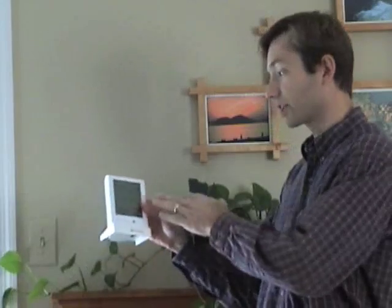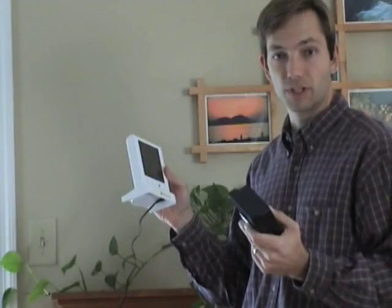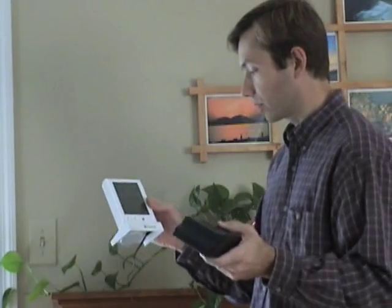When programming inside of the monitor, there are four things to consider. The first is to make sure that the monitor is reading the signal from the transmitter. If the monitor seems to be reading something that does not match up with what's happening in the house, it could be reading a signal from another transmitter nearby, receiving interference, or may not be reading the transmitter.